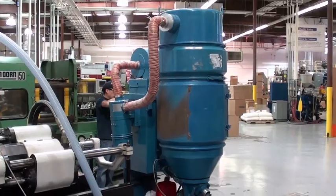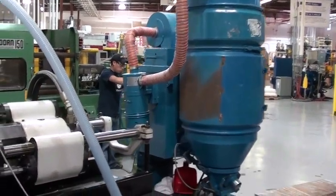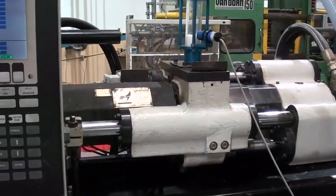The video here shows the sprue that contains the warhead and aft nozzle insert parts being installed in the injection molding machine, and then the very first parts being molded. Here are the two halves of the mold tool that will come together to create the finished part.